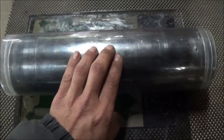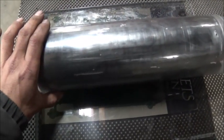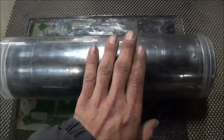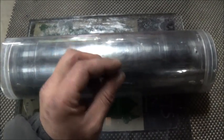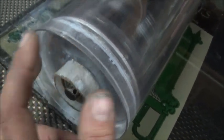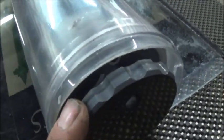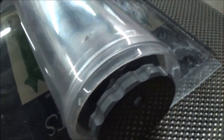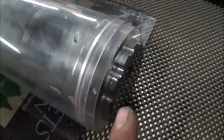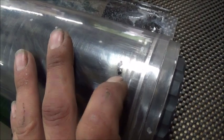The inner wheel you see inside is the toner wheel from an old copying machine. What I've done is taken some plexiglass and made a case around that toner wheel with about a piece of paper's thickness between the two — a very, very narrow tolerance. At the end you can see a bearing for the toner wheel; I've got plexiglass glued together with a seal all the way across to keep air pressure correct. On the other side I've got a knob, and behind it is our air out; here is our air in with our first tangent hole.